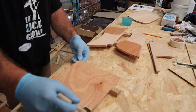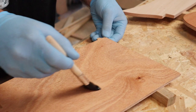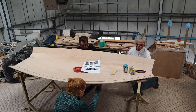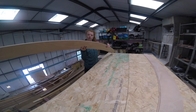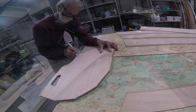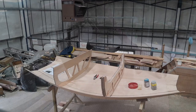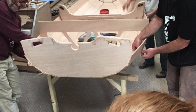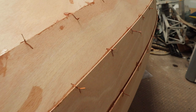Each piece of timber had to be sealed with epoxy resin to make it waterproof. Here I am working on the centreboard trunk and the rudder stock. The dinghy is built using the stitch and glue technique. Copper ties are used to hold the planks in place and then epoxy glue is applied to the seams. Once the glue is dry, you can take the ties out. The planking is 6mm plywood, which means for a wooden boat she's quite light.